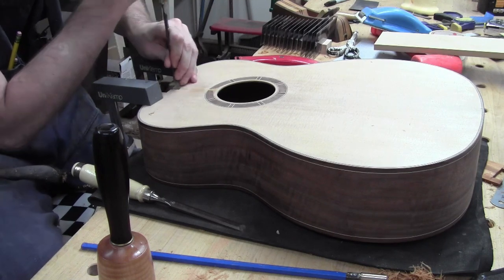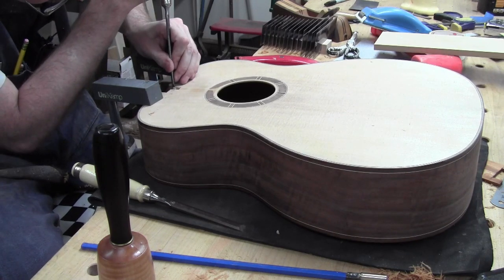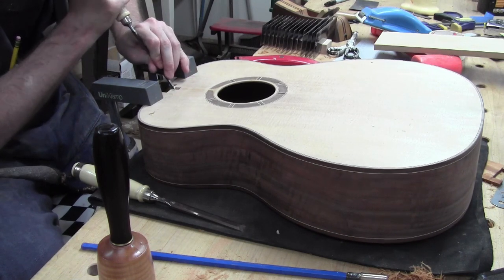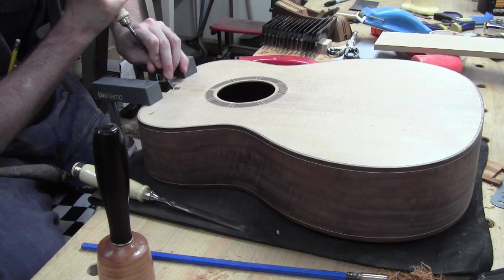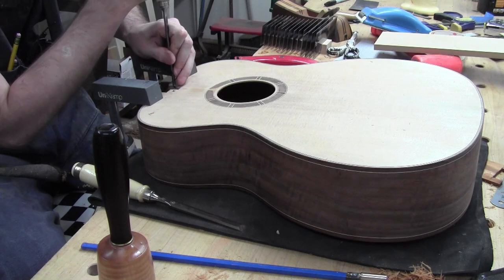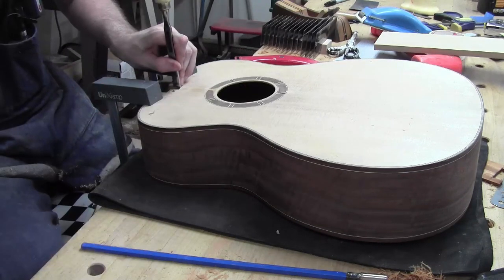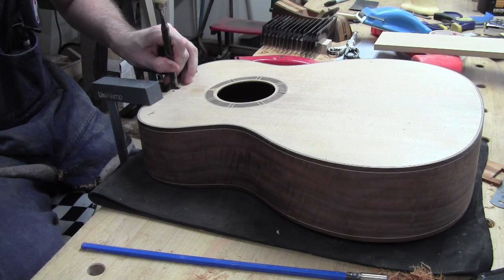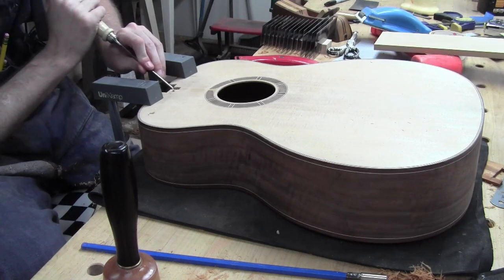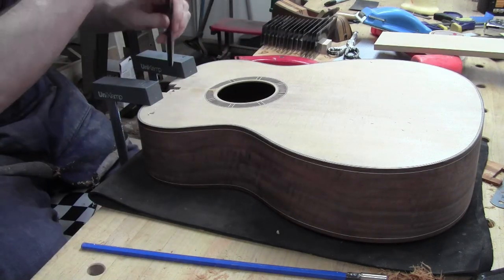We're basically chopping a mortise, so you can do it that way. You pare backwards kind of thing here. Let's remove some fibers here so I have a wall I can work alongside of. There we go. And like that, and then we can just come in and pop those things out. Now we can come in again with the big chisel. We'll take a little chance to score these fibers a bit. And then we can come right back with our side slices here and do the same again until we reach our depth. We'll just keep doing that.